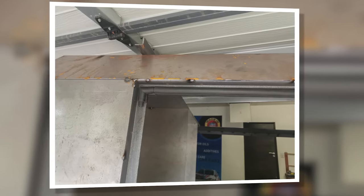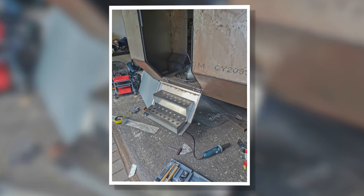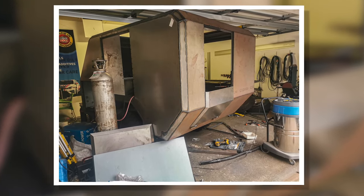The recessed lip that you can see in all the openings was created by joining two pieces of angle iron to form a frame. This gave a lot of support and structure to the openings and also formed the base for the automotive-grade rubber seal. This rubber would be used throughout the trailer to seal up all the doors and hatches.